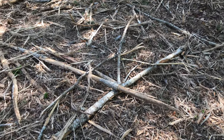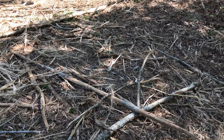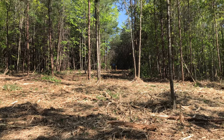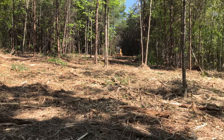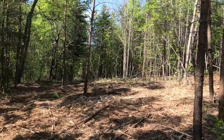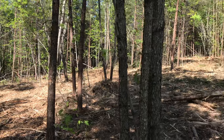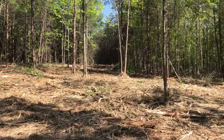On this site I'm very comfortable with this kind of slash because I want mushrooms to grow, I want to have firewood, I want to have other resources while I'm getting to the final plan. Now he's going to widen that trail. For a regular road, if you're going to have a truck, you want 13 feet wide. A lot of these trails are eight feet wide, which is okay for a four-by-four or a quad.